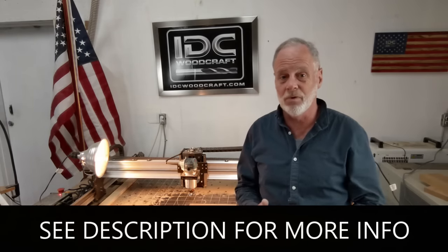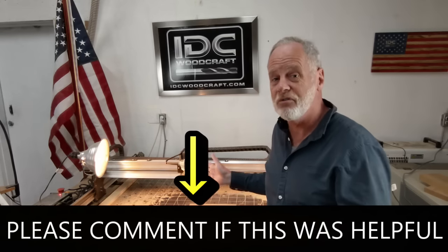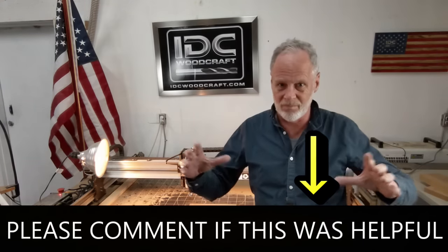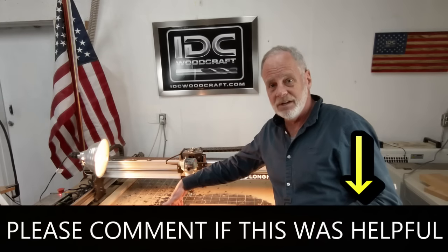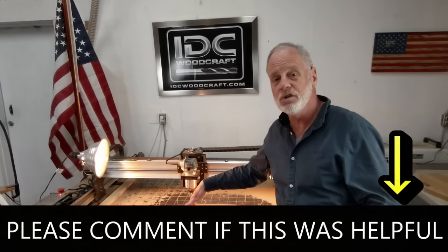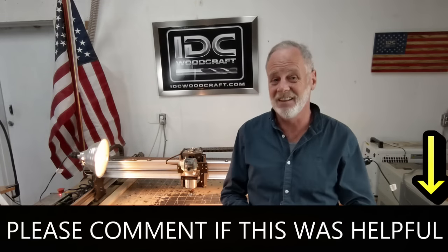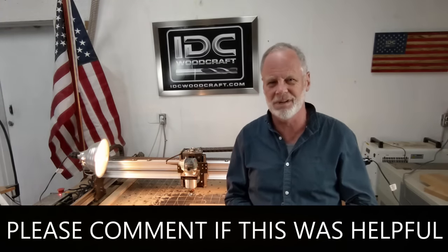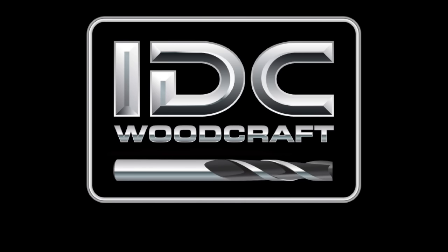The CA glue Starbond brand with discount code is listed in the description. Remember the ultra smooth surfacing bits — the 1.5-inch works much faster than the 1-inch, and now you know how to set this up in the design software. Your project area in the software must be wider than the actual project so the CNC router bit comes down to the side of the project before making its cut. Never let a surfacing bit plunge into the material unless using a very long ramp — there are no cutting edges on the inside bottom of the bit. If this video was helpful, give me a thumbs up and leave a comment. Thanks for watching — idcwoodcraft.com.